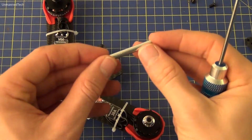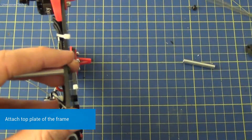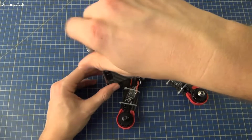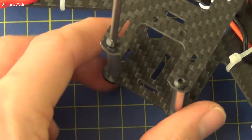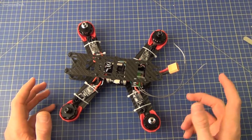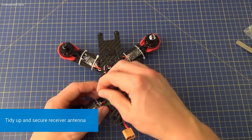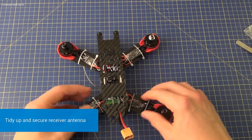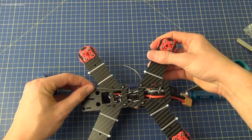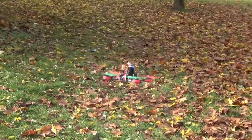We're coming to the finishing touches now. We have to attach the top plate, and in order to do that we first attach the silver standoffs to the bottom plate as shown, and then simply screw on the top plate. Now we have the top plate on and we're almost done — we just need to tidy up the receiver antenna. I've put one up through the top plate as shown and one running along the bottom plate, and we can secure them with a bit of electrical tape. And we are all done with the build side of this kit. Thank you for watching.